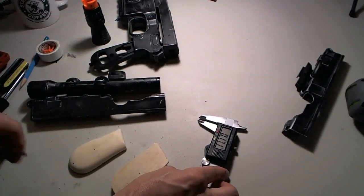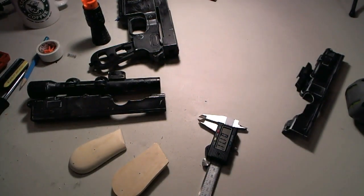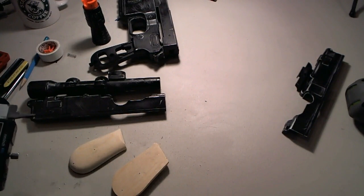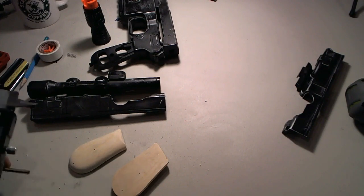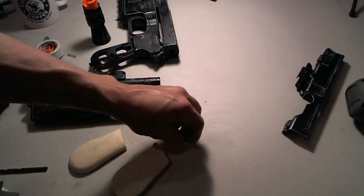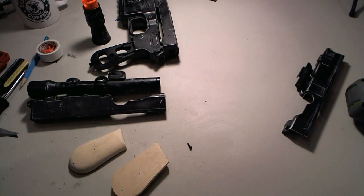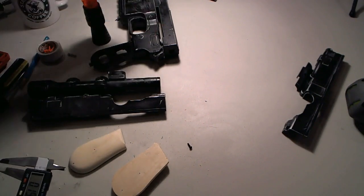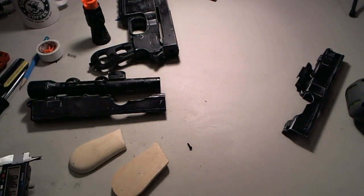So I'm going to need something that's like 0.2. So let me check. Well, actually, why don't I do a 190, just 3/16. So that's 0.17 right here is what this one measures out to. Oh, there it is, 0.18. 0.190 round up. And this one is 0.17. 0.17, 0.190, that might do it. If not, I can go up to 7/32. I think that should do it.